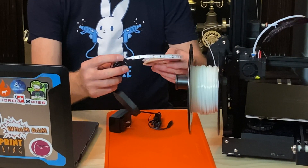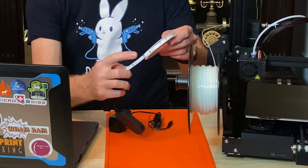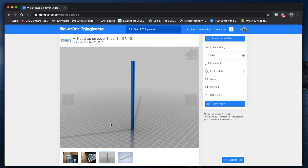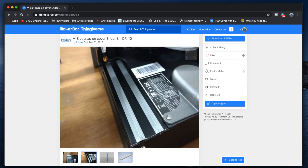All we're going to need to do is cut the LED strip to the appropriate length — it's got markings on it to show us where we can cut. For the light diffuser, we'll print this STL file in natural or clear PLA. The diffuser evens out the light from the LEDs, providing a consistent level of illumination. What we're printing is really a printable insert for the V-slot channels in the aluminum extrusions, designed to keep dust and debris out. Because they simply clip into place, they make an excellent diffuser when printed in natural PLA, which has no added dyes and doesn't block much light.